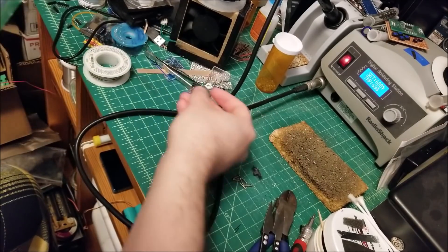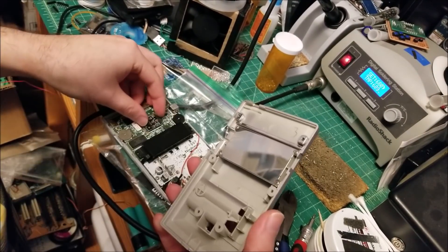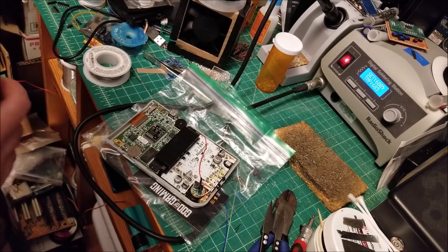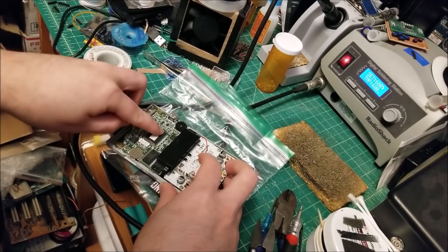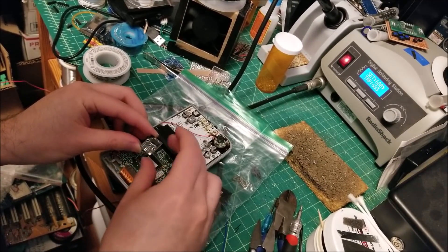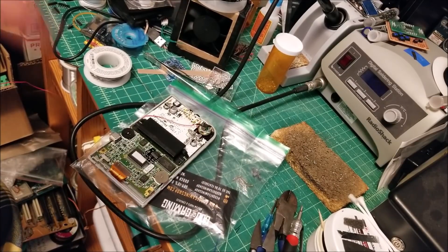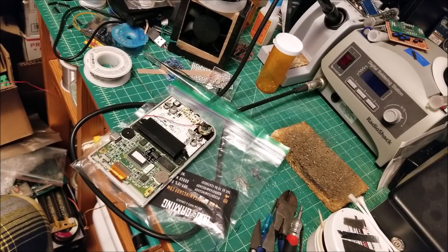This is going to be quite a bit more involved because we will need to cut some traces on the board. We could mount the bivert chip right on top of the main chip, so the wires would be nice and short. We'll need to use thinner double-sided tape — cut a little rectangle and put that on top of the chip for now. We'll need VCC, pin 1, pin 3, and then obviously the two pins coming from the CPU itself. I'm going to link an image in the description — a nice wiring diagram posted by Handheld Legend, who also sells these bivert chips.